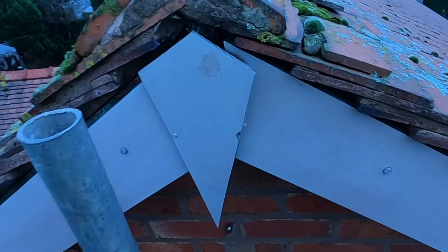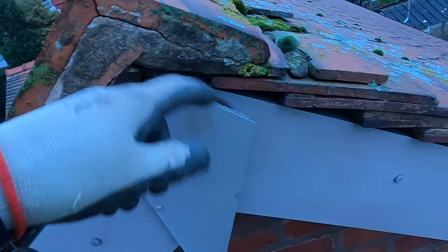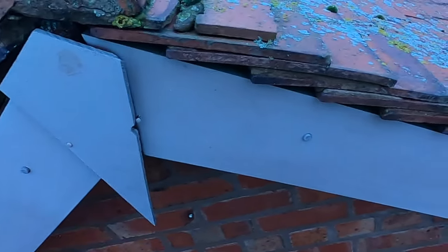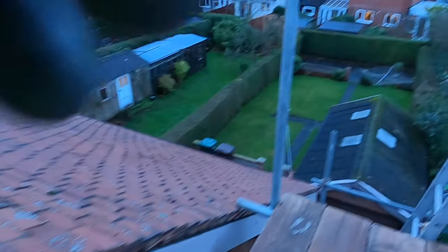fascia board. I think he said they put 20 mil stuff on, which is too thick, so it's lost the overhang. So this is all getting replaced. I'm not sure if the timber's coming off, but obviously, ideally, this timber will come off. So that's all getting done while the scaffold's up. And there's our brickwork. The actual pikes are solid. Solid 9-inch, as you can tell by the headers. English Garden Wall Bond. So this is all treated now, down to that window. So I'm going to go down now and get the rest done and start cleaning up before this heavy rain comes.